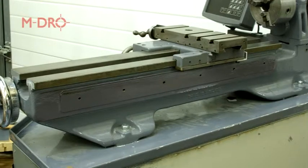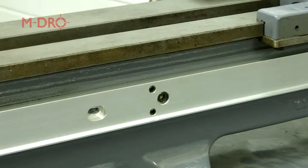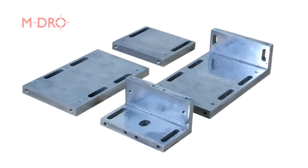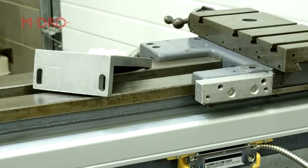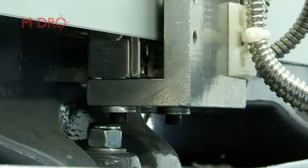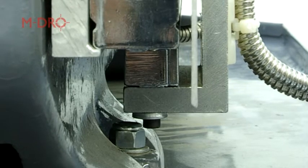There is a line of existing threaded holes for the taper attachment. We can drill and counter-bore the backing plate to use two of these existing threaded holes. Near these fixing holes, two grub screws were also drilled and tapped; these act as jacking screws and can be adjusted to bring the backing plate parallel to the bed. The linear scale now needs to be placed in position to work out which brackets we will need for the reading head. Looking at the standard bracket kit supplied, the long L-shaped bracket can be used with a packing piece drilled and tapped with jacking screws, allowing us to adjust the packer to the correct thickness and angle. The packer can also be tapped with the appropriate fixings to use a pair of slots on the bracket, which will also give us the height adjustment. The reading head is attached to the bracket via two tapped holes on the underside, which allows for adjustment to centralise the reading head with the scale body. The combination of jacking screws and slotted brackets provides the means for simple adjustment, making fitting the scales much easier.